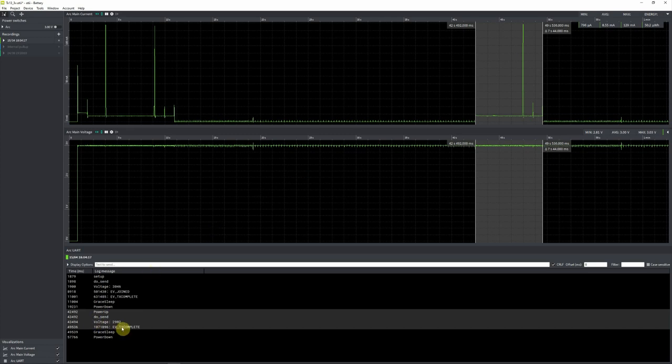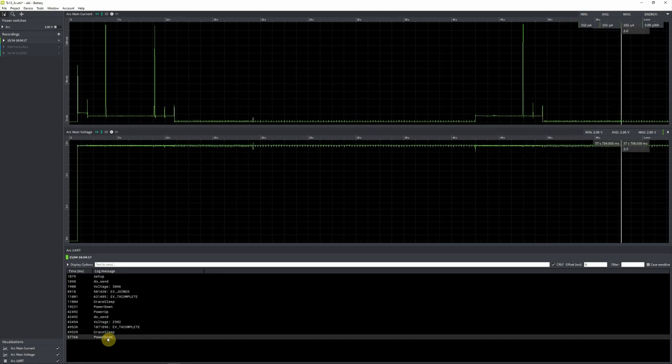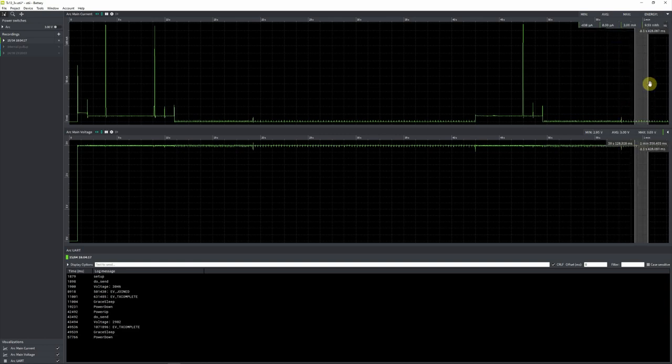And when the transmission is complete, we again enter a grace sleep where the device is sleeping for 8 seconds and it is not listening for interrupts. When that is complete, it again powers down as much as possible, and we have a pretty low current consumption.